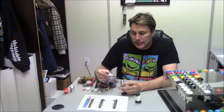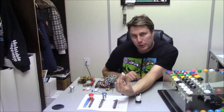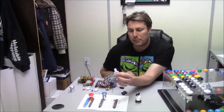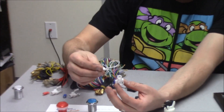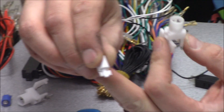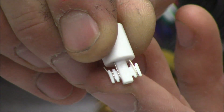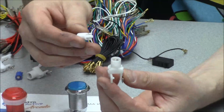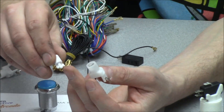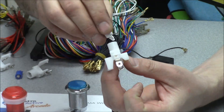I'm going to go over how to wire up LEDs as well. These are chrome LED buttons. They come with a lamp holder, which is pretty standard. You take your little LED — on either side you'll see two different wires. There's a thick wire with one wrap and a thin wire with two wraps. The thin wire wrapped twice is your line in, your power or voltage. The thick wire is always your ground. I advise making them all the same — I always put the ground on the bare or short side of the lamp holder, and the power on the long side that holds the micro switch.